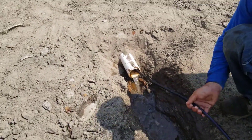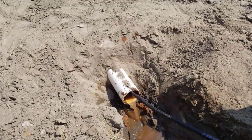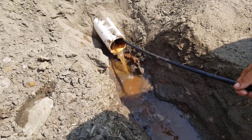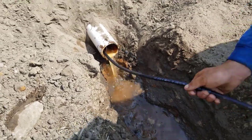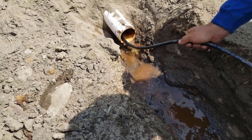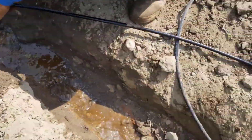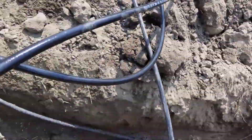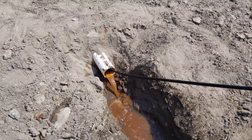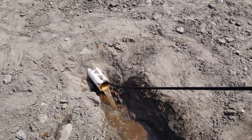There's a lot of research being done, and the hope is that somebody comes up with something you could just put in the sump pump pit — maybe force water to back-feed into the floor drains — and it dissolves and breaks down the iron ochre. As of right now, all such chemicals are illegal. You don't want that going into the city storm drains. There are chemicals that actually do work, but I'm not going to give you the names, because people without a conscience are already using some of these very harsh chemicals and allowing them to flow into our environment.